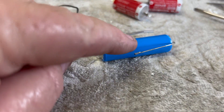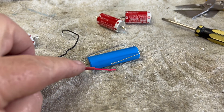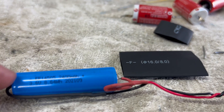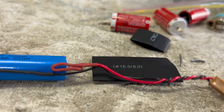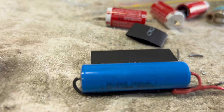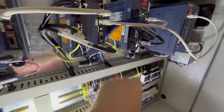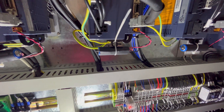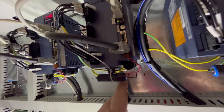I've tinned this wire here and I've tinned the positive wire here. I've also put my heat shrink on and I'll solder that to the positive terminal. I've soldered the wires on now and I've done a little return there — it's not the best, but it'll do to keep the wires as long as I can get. I'll now put the heat shrink over it and shrink wrap it. I've got all three batteries back on here now for the X, Y and Z. It's not my proudest work, but it'll get me out of trouble, and I will reorder the proper batteries that go up under here on these drivers.